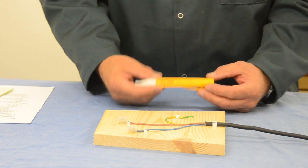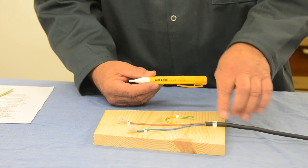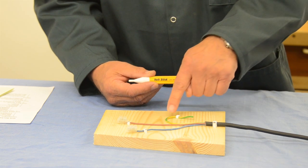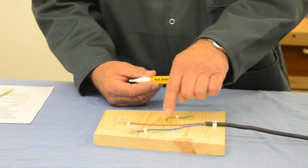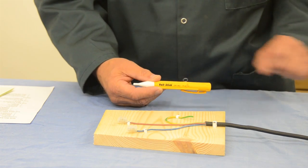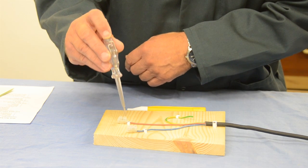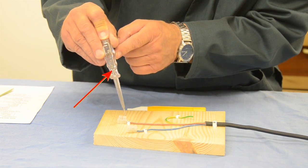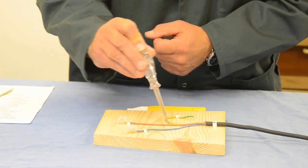Now let me give you a quick idea of how the fault stick works. I've got here an electricity cable divided into its three core parts: a blue neutral, a brown live, and a green and yellow earth. Right now this cable has got live electricity in it, and this brown live wire is live right now. In the old days you used to have to take one of these funny screwdriver gadgets, which has a little neon in it, find a bare piece of wire, touch the end of the screwdriver on, and look very carefully to see if you can see the neon light up.